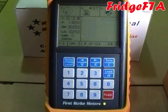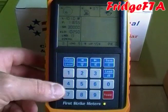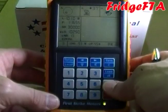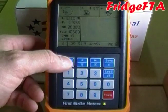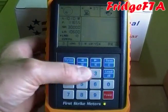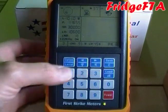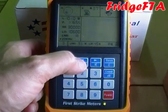You can change any of the settings by using the option key to arrow to the setting you want to change, then simply type in the new information. Press the option key to go to the next item. 13 volts is vertical polarity; 18 volts is horizontal polarity. Be sure to turn 22 kilohertz to on if you're using a universal LNB and you're using the high band, such as with the Spitfire Elite for North American satellites.